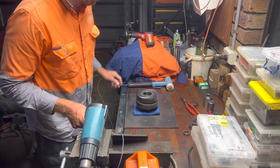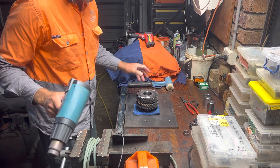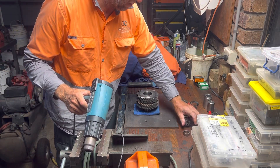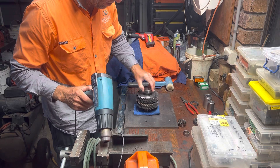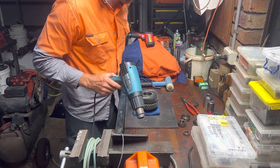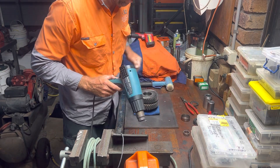We'll do a bit of heating and see how hot it has to get for that cup to drop in. I can even use one of these as a tester - clearly that won't go in at all at room temperature. So if we can get that to go in, I can pull that one out and drop the actual bearing in.